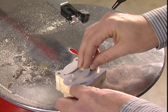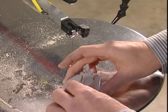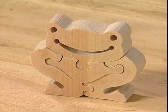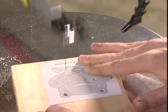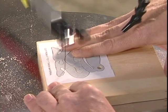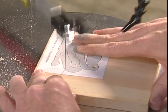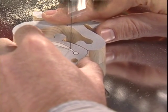That's important if you want to make a puzzle that goes together and comes apart correctly. The blade carriage system on the Hawk keeps that blade square and under just the right amount of tension while you're busy following your pattern. The cut edges look like they've already been sanded — well, they haven't. That's part of the exclusive stroking action of the Hawk. On the down stroke, the tool makes the cut, and on the up stroke it cleans out your cutting area and literally polishes the edge. Every woodworker loves the sound of these three words: no sanding needed.